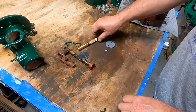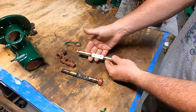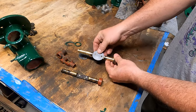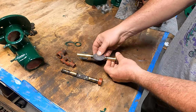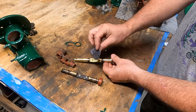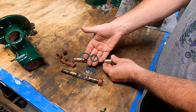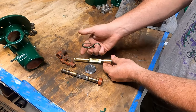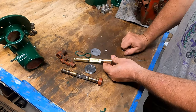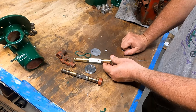Here we are a little closer. Here's the throttle shaft we made — here's the old one, and the new one that doesn't have any wear on it. This throttle plate we just made goes on there with some bolts, then it rotates and that's what controls the fuel mixture. Here's the old throttle plate — you can see what shape it was in, not very good. Here is that spring handle we still need to make — that'll be in the next video. Just a few more parts and we'll be getting this mixer back together.